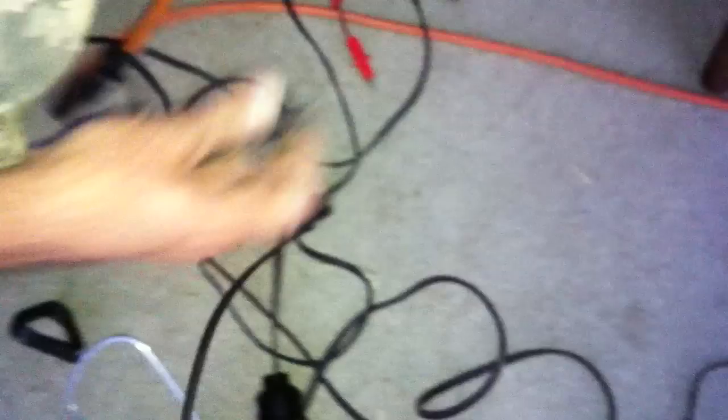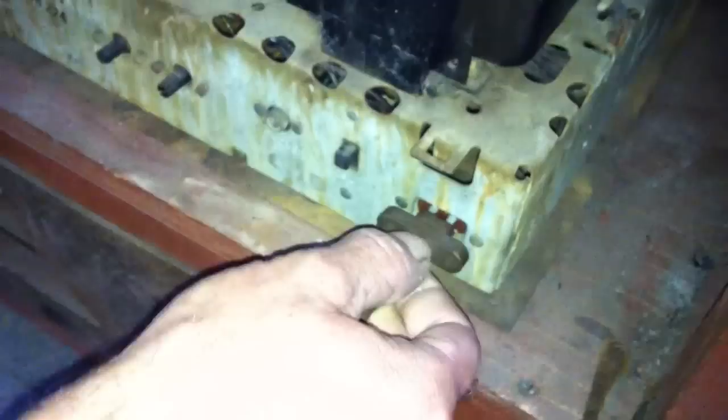So we only got 1.6 volts on the CRT filament. There's a TV/phono switch — it was in the wrong position. So we're going to try again. Why would that cut the filament to the CRT off? Well, maybe it won't — obviously it did, because there it goes, it's glowing. Maybe we'll have audio now. We had audio before — well, crackling. We had the amp but no picture.